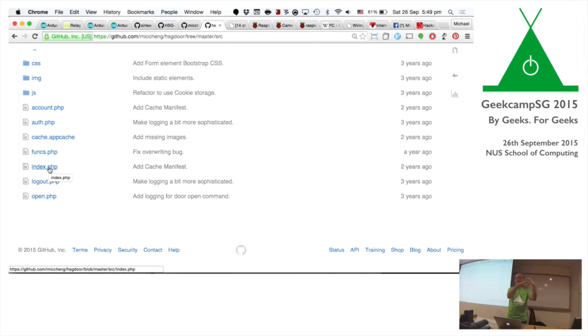So basically, you have a web application outside of our network, and it exposes a little number pad. When we press a button, it calls a JSON API using jQuery. So you write a simple basic web app, and using jQuery, it makes a call to your web server, and on your Apache web server, we have a reverse proxy that talks to an IPv6 address internally in the hackerspace itself, which in turn calls the door and tells the door to open up. Yeah. I don't have a diagram. So does it make sense to you?